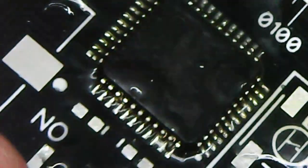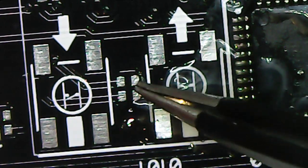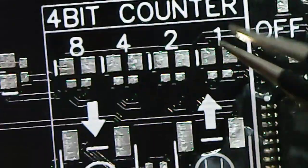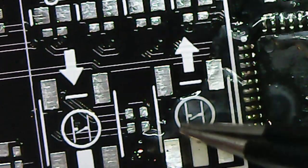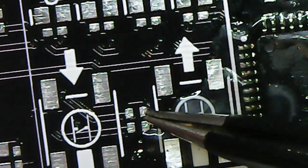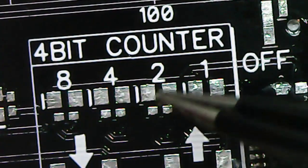Now the on-off switch. Same approach: get some flux, make it transparent, put solder on the top connection, get the component — there are little holes on the board that help line it up in the correct spot. Hold it down and reflow that connection. It's now held in place. Solder the remaining pads, giving the solder enough time to flow since there's quite a bit of metal. For the capacitor: even though the board has polarity markings with white lines, the capacitors we're using aren't actually polarized, so it doesn't matter which way you put them in — they'll be fine.